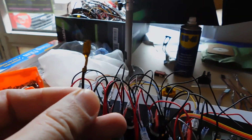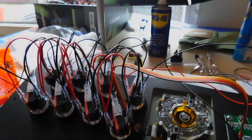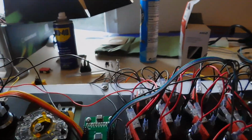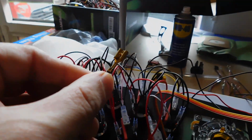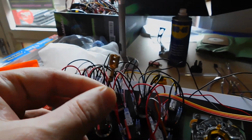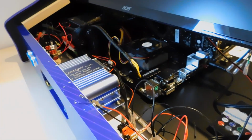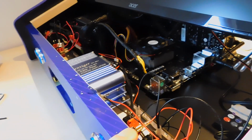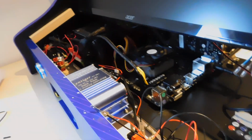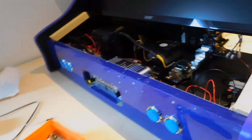Yeah, I crimp all my connectors for the ends. I do buy these ribbon cables shielded, and then when it comes to customizing the wiring to make space between and stuff, I add some new wire, crimp the wires, shield them, and then on the ends here I'll heat shrink the ends of these to connect inside here. These are all joined together with the board, and then I'll heat shrink them. I'm looking maybe for a quick release connector of some sort just to make it easier, but when the board goes on, it can come out and come over and sit nicely on the front of the machine.